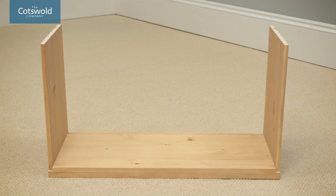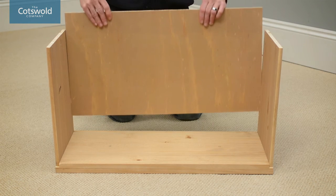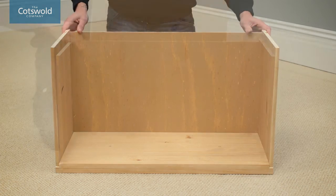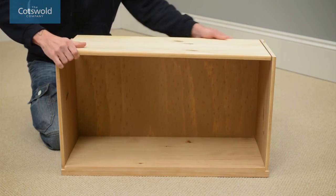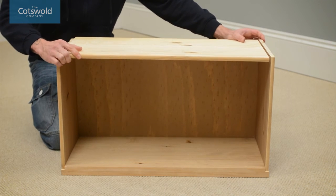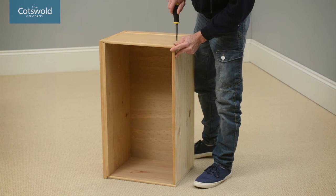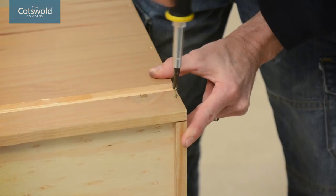After this, place the drawer front face down with sides pointing upwards. Simply slide in the drawer bottom from above, taking care to align the recesses correctly. This will enable you to position the back panel of the drawer correctly. Now you have an almost complete drawer. Next, you'll need to fix screws into place to secure. Turn the product around and fix the remaining 2 screws.